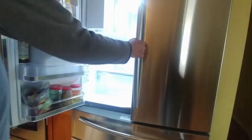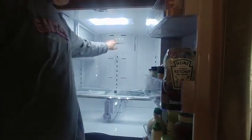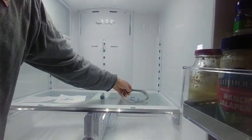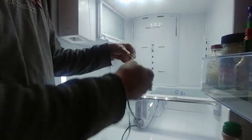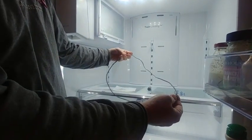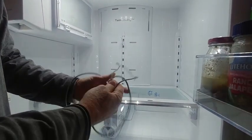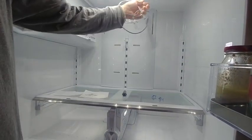If you've seen my other video, and probably a bunch of other people's videos, you'll notice that this all freezes up here. So I did some mods before — it lasted a few years like I said. Now I'm going to put a separate heater around the top section. This one is only 15 watts for a 120-volt system, and it's going to get tied into the brown wires of the other heater.